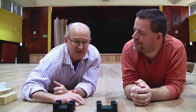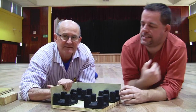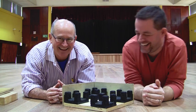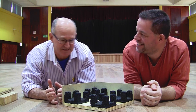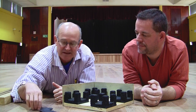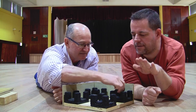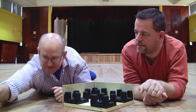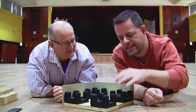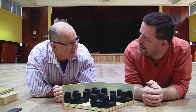Let's put some stuff together so we can see how it works. We'll start with the demo box. This is our base system: you've got your rubber cradle on the substrate, and into that rubber cradle you will put our plastic shims — these little 5mm shims and 2mm shims. This is what we micro-level the floor with. I just want to point out that these have been really cleverly designed — because of these little hooky parts, if there's any continual vibration they're not going to slide out of place. It holds the whole system together.